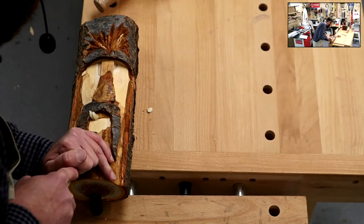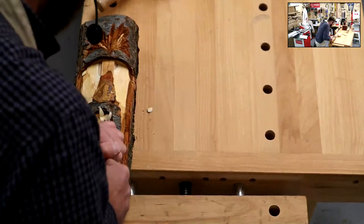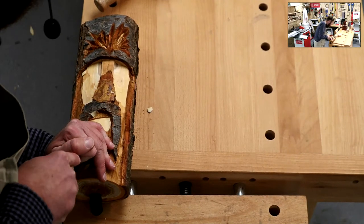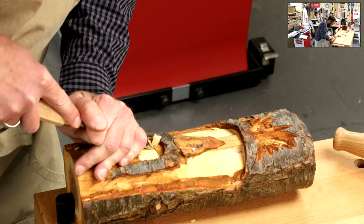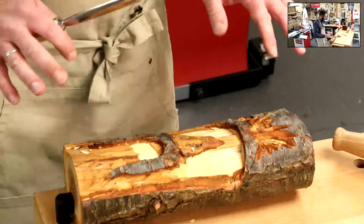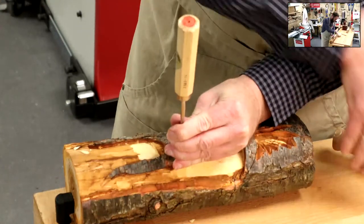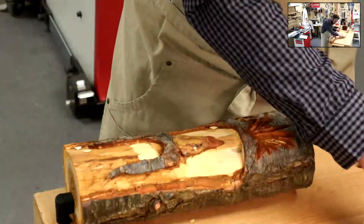Sharp gouge, just going to cut straight through it. It's given me a lovely finish, and to begin with, I'm just kind of flattening the surface. I'm carving down to where I want it, and we'll come back in and we'll put that lovely texture back in with a bit more shape on the chisel. We will achieve that nice kind of faceted look. Bit more to do around here. Let's just come in on there. So a little stop cut.